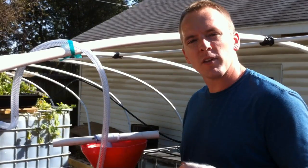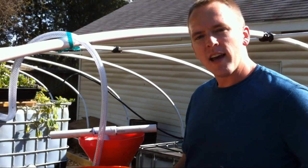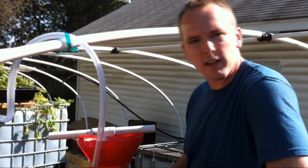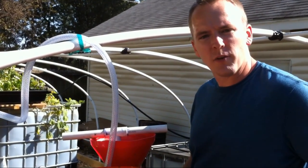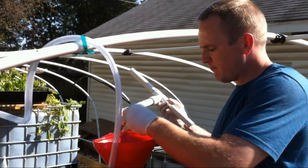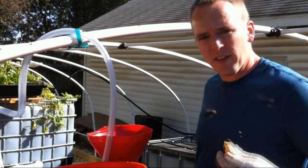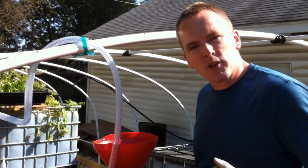You should go out to local restaurants and make a deal to get their leftover food waste for your biodigester. It's way better than just using cow dung or chicken waste — there's way more of it. We just picked up 800 pounds of rotten food waste. The super rotten stuff we're grinding up, and it'll produce methane for seven or eight weeks. It produces a lot within one week, peaks in the second week, and then keeps going. By the time it's fully digested it almost comes out as a clear liquid.